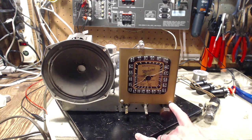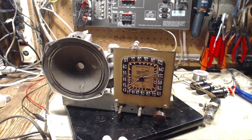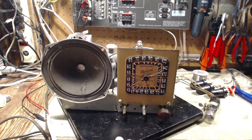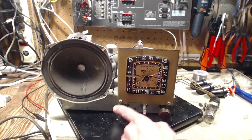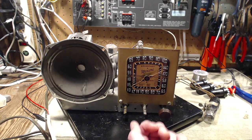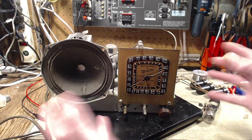It's this screw and this screw. I think you can see in the camera that they're not the same. They're not the same type of screw. So, what's that saying? It would be very unusual for there to be two different types of screws here right out of the factory. So my guess is someone previously removed this plate from the radio. Perhaps this plate has even come from another, identical radio. Maybe a couple radios have been put together here.